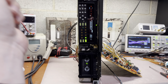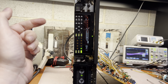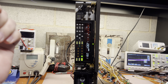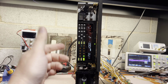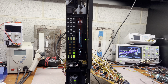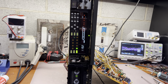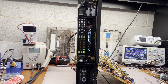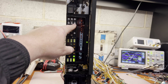I was able to tune up the frequency response on playback and now it plays super cool. I'm so happy with the sound — I pretty much enjoyed listening in source mode, and I decided to restore this deck 100%. When I adjusted the frequency response I found the sweet spot and it plays super cool. It's flat up to about 12 kilohertz, and up to 15 kilohertz it shows a little slower — about minus two decibels — but all in all it still sounds really cool. The indicator works again in all modes.